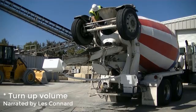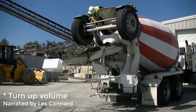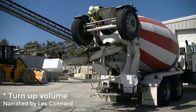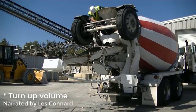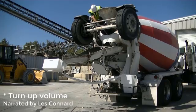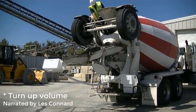This system was devised for what's called scrape and go. For job sites that say we don't have room for you to wash out, you need to just take it off the property with dirty chutes. I made this so that a driver would just have to have one area that he could wash into with a bucket, and the lid makes it a tank when you snap it into place and bring everything back to the yard.